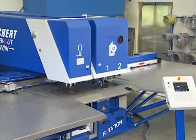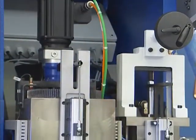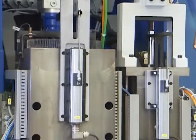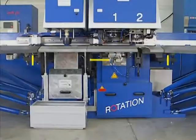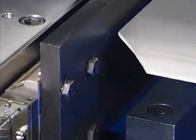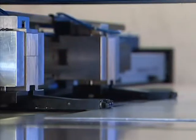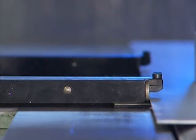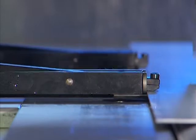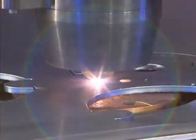The basis of all CombiCut machines is the well thought out technology and robust construction, starting with the solid C frame and the upper punching head with motor, the toothed gearing, the stroke measuring system, and the automatic stripper and indexing mechanism, through to the Trumpf tooling system for standard tools and Revo tools. The large distance between the ball spindles on both sides with linear guides guarantees high axial stability and accurate positioning. Repositioning of sheets with a length of up to 10 meters is possible without problems on all CombiCut machines. A distinctive feature is the repositioning of the clamps without touching the metal sheet. All models are equipped with balls in the table, enabling easier handling of heavy sheets.